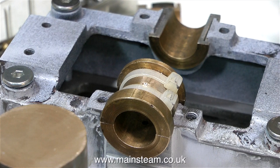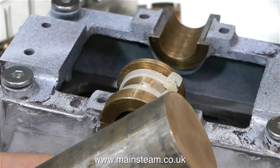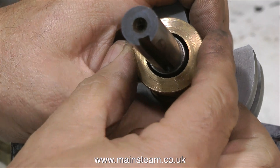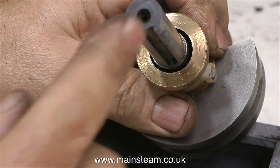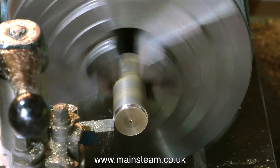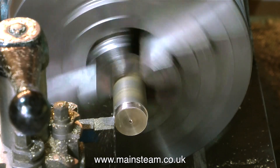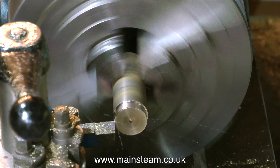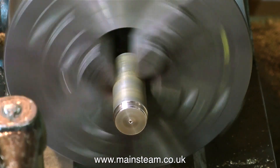As you can see in this clip, this is a large lump of phosphor bronze that I was about to make some new bearings from. But then I thought - I have a plan. First of all I'm going to make the sleeves that fit in the bearings, and to make these bearing bushes I'm going to use my Smart and Brown lathe. Here it is and the job's underway. I'm going to speed up this process otherwise the video is going to be very long and very tedious. I'm taking great care to get this bearing bush to be a really good fit in the original bearings.